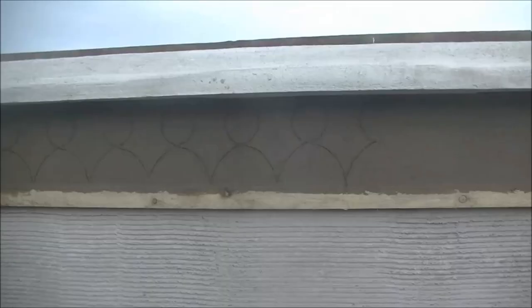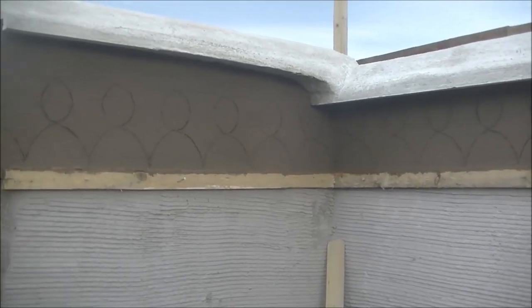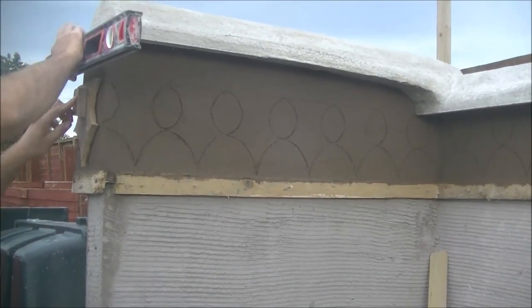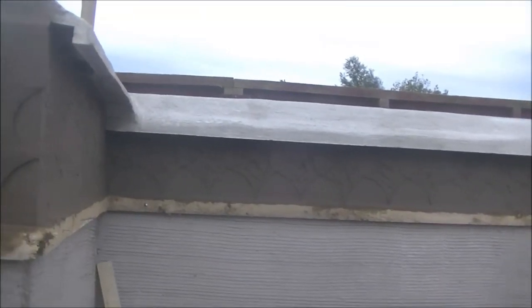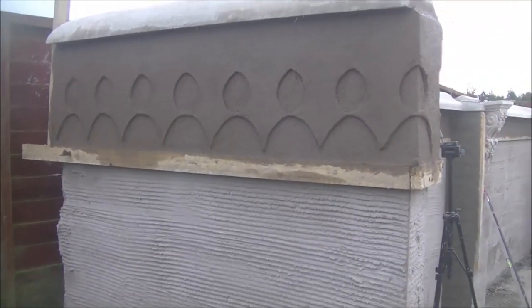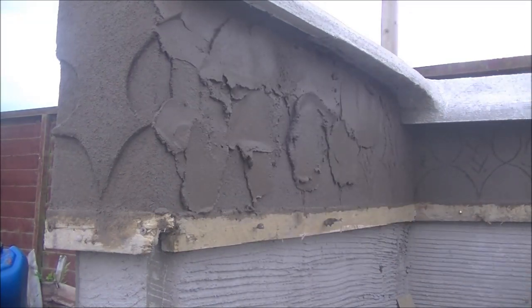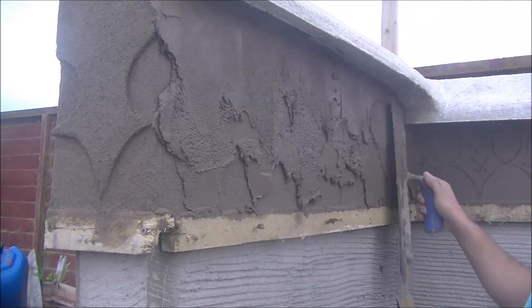With the detail, if I had it in a slipknot on my string — which I didn't bother — it would have kept everything even more precise, as what was happening was when I was trying to create some curves and rounds, the string was actually coiling up, which was throwing me a couple of mil off. What I've done here is I've measured and marked out, given a bit of a scratch coat just for a bit of a key, and here shall be a bit of a visual of what the rest is going to look like, as that end of the wall is completed. You might remember at the bottom of that wall there was rain there, and I broke my own rules and went over it for a bit of a test. I have recently checked it and despite getting a lot of rain, it's still solid — but let's find out what the winter says.